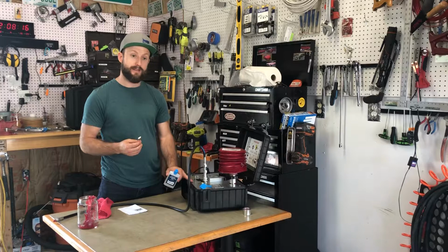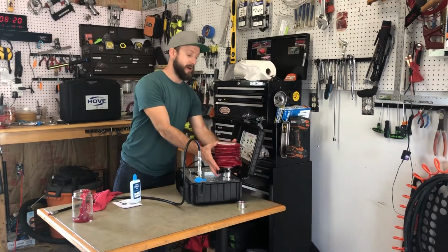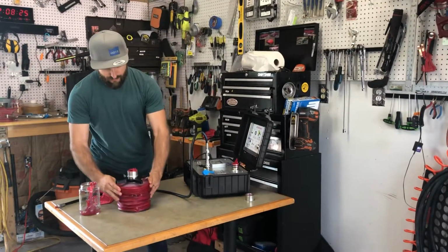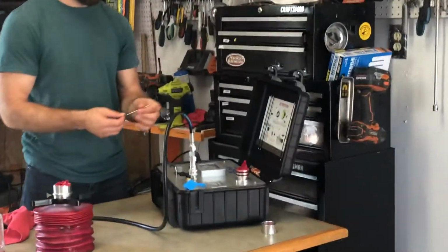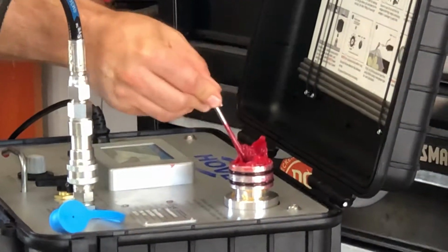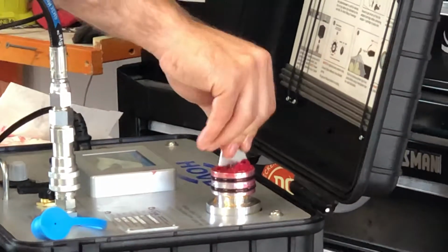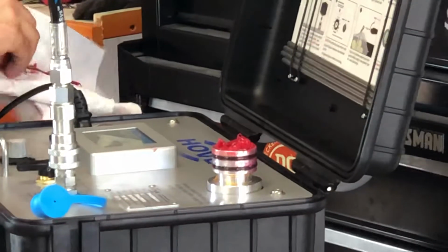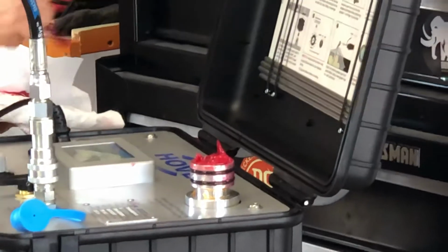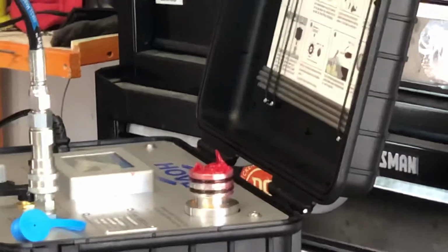So if your pump isn't moving grease, the first thing you're going to do is take off the cartridge of grease and set that aside. You're going to take the priming key, stick it down in the grease inlet, and you're going to scoop out as much of the grease as you can reach. And this is making a channel for you to enter some of the priming oil.